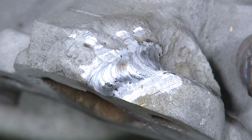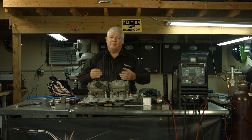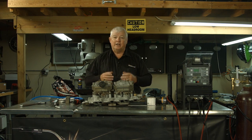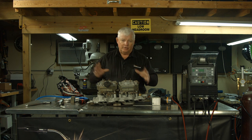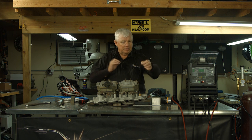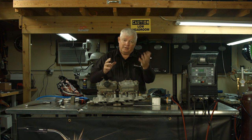I just want to recap this because you're going to get involved in a lot of aluminum and the aluminum oxide is just absolutely horrible — you've got to try to get it off. The machine will take some of it off, but you may have to go in there and grind. If you get into cylinder heads, they typically have the same problem — oxides, oils, and things like that. When you start welding, your arc will just start bouncing around. So go ahead and make one weld, and if it looks ugly, go ahead and grind and get rid of the oxides.